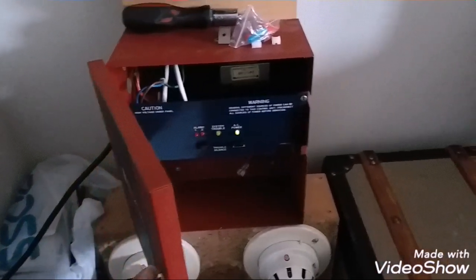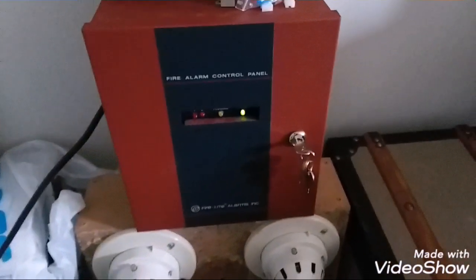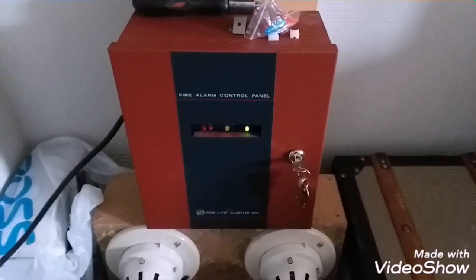The only trouble is the battery. I did verify that all the zones are good and all the NACs are good. I also finally got a three-prong AC cord, so now we're grounded and on the safer side — I've been using a two-prong cord for the longest time, which is a little bit unsafe.